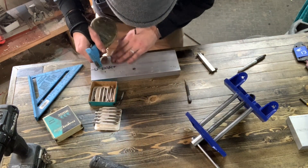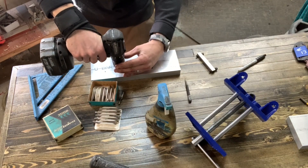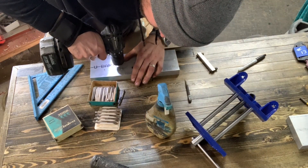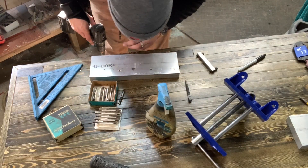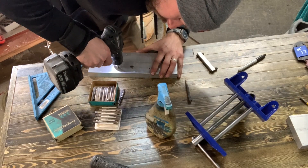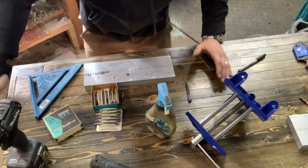I've got my two holes drilled. I'm going to put a little bit of oil on them and try to tap them here. I've just got a quarter-20 tap in my drill and I'm going to try to get it nice and straight. The only issue I may have is I might have to shorten my one inch bolts a little bit if I didn't get it deep enough, but let's see if it works.